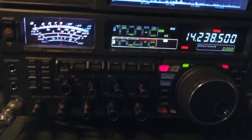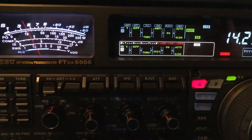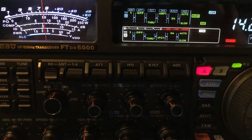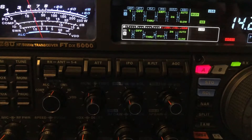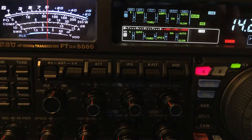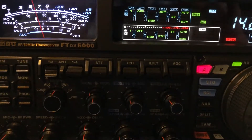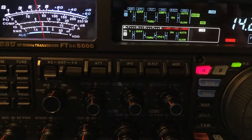Hopefully that'll give you an idea of the gain you can expect. Now with that gain on the higher bands, you're going to take some losses — you get lobes of gain and you get a few nulls. Mine are not too bad, just a couple of spots — seems like the Saskatchewan direction and maybe Chile.